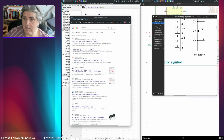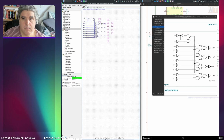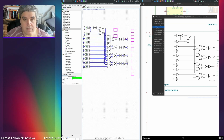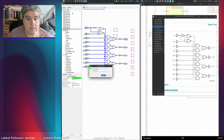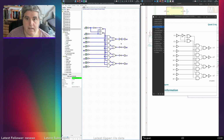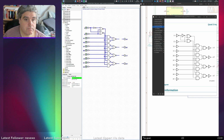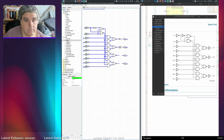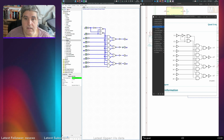So that's pretty much exactly the same as the 157, but without these inverters on the end here. So that's an easy change. I'm just going to copy the whole lot there, add a circuit, SN74HC158, and paste it. Take out these inverters and replace them with buffers. No need for these buffers to be there really, but they're in the schematic, so I'm having them. Okay, hook these up.